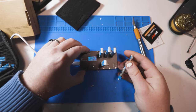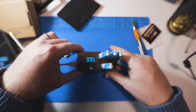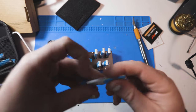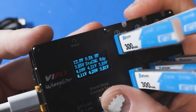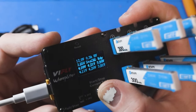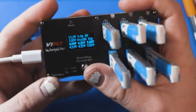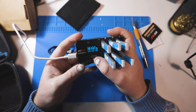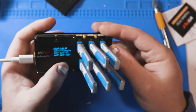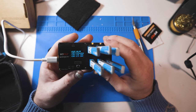Maybe I should put this bad boy to storage. Oh, that's cool — you see it change on screen: charge, storage charge. I'll go ahead and storage charge all of them. If you press this button here, it changes the amperage you charge with and you get to choose between 0.2 and 0.9. I've got a full rack of batteries so I'm going to put it to 0.9 and hold the start-stop button. It put one on and said okay — that means it's done charging that one. That's a fun way to say it.